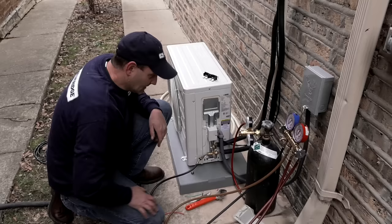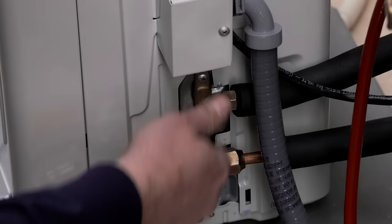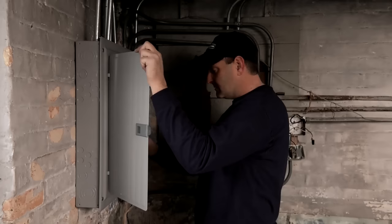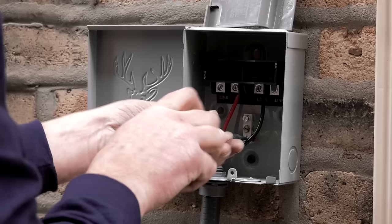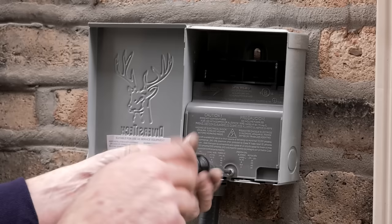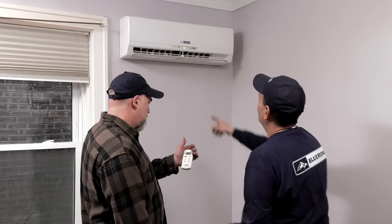After the vacuum is complete, close the manifold gauge valve. Use an adjustable wrench to remove the service valve caps and use an Allen wrench or hex key to fully open both service valves, releasing refrigerant into the system. The condenser requires 220 volt power from a dedicated circuit on your breaker panel, run through an exterior mounted manual disconnect box. A qualified technician should install the circuit breaker, disconnect box, and make a high voltage connection to the condenser. With the refrigerant released and all high and low voltage connections complete, it's time to power up the system and do the initial startup. Start the system with the remote and check for proper operation.